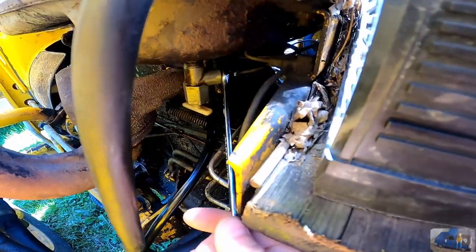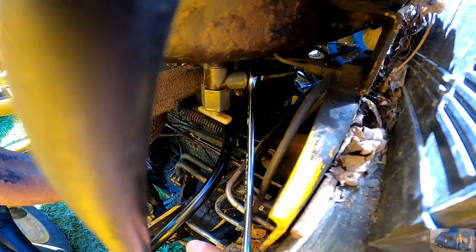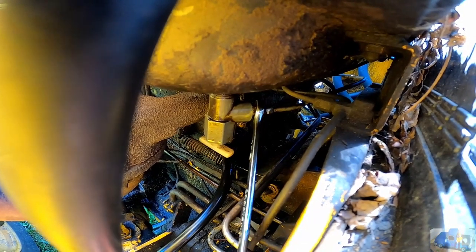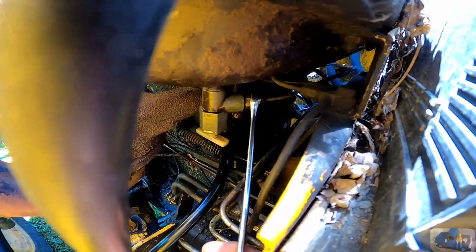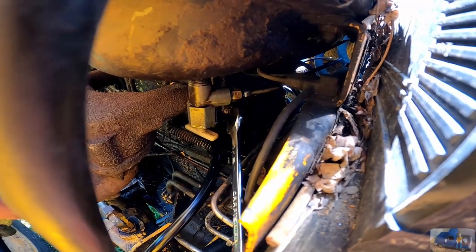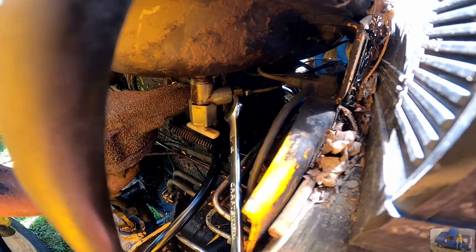And when I put the wrench on it, she's loose. Whole line's moving. They tightened that brake line in there, and they didn't make sure this adapter was tight. And I think we're sucking air right there. So it's a real "here's your problem" kind of moment.